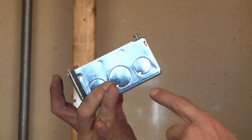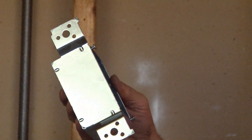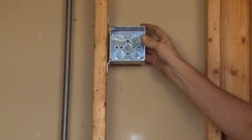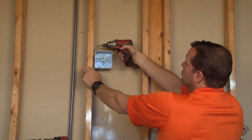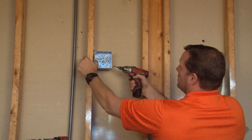All three sides are identical. It comes with a flat vertical bracket on one side that does not have conduit knockouts. The flat vertical bracket allows you to simply place it flush with the face of the stud, and take your screw with a screwdriver, and securely mount it directly to the stud.